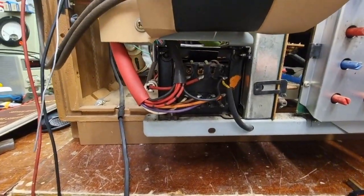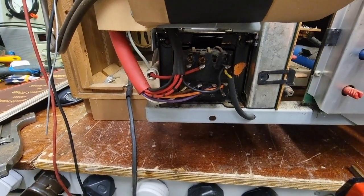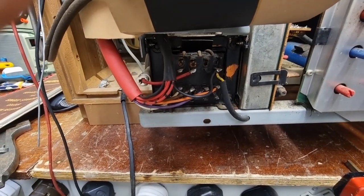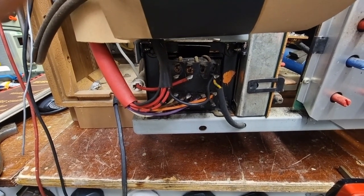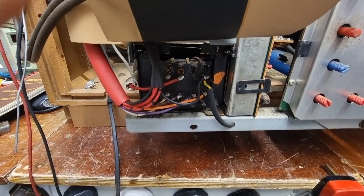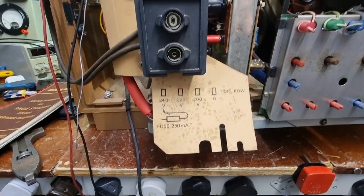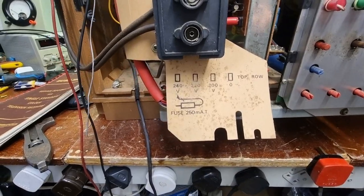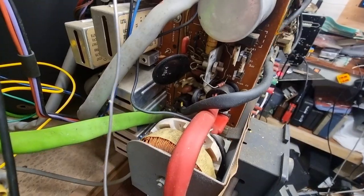We're on the 220 volt setting, which was the style of the time here in Ireland. Republic of Ireland was 220 volts nominal, as opposed to the UK's 240 to 250 volt nominal, but that changed sometime in the 90s, and it's supposed to be harmonized between the two at around 235, but it's often more than that, and here it's usually around 245 to 250. So we're gonna move that tap as well. Anyway, I'll get the board out and we'll change that and we will continue.